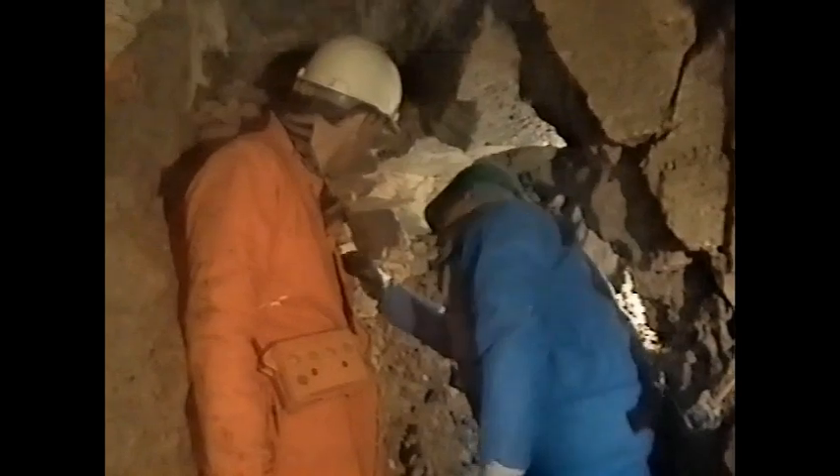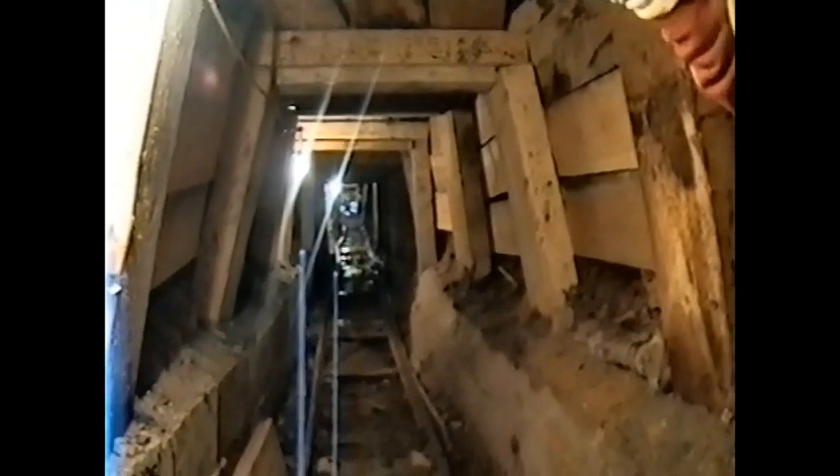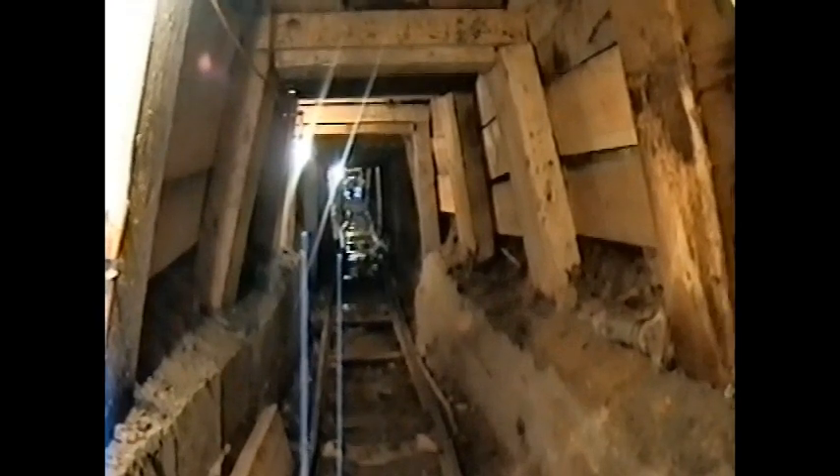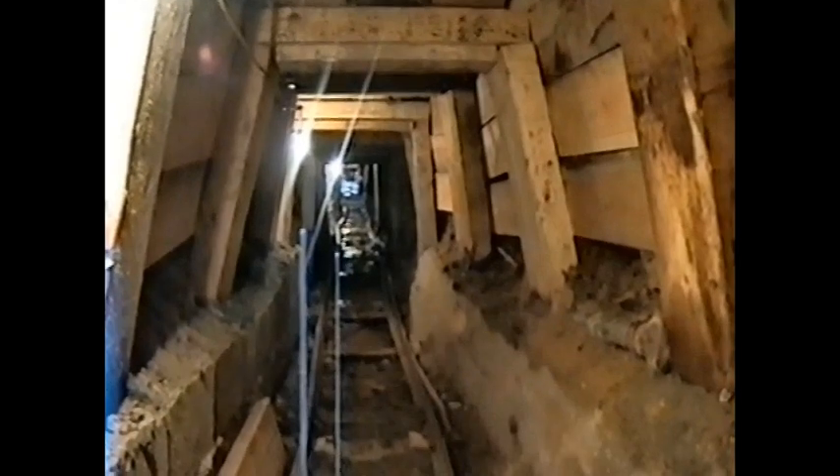This is a typical problem. We've had flooding from rain. There's a backdrop in one of the chambers — sorry, the next one down — because there's a back fall on the system. That's partly why it's happened to be done. We had water problems the other side, not so much this side. What we had here were some of our own doings with the pumps over-pumping. We're over-pumping now from further back, but we have actually got this pump standing by should we have any surcharge.